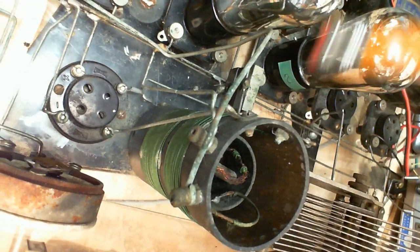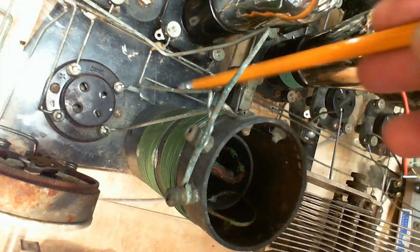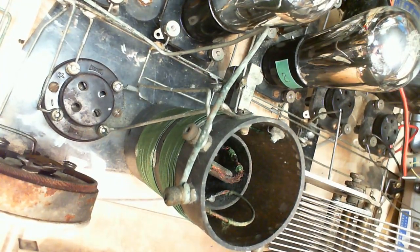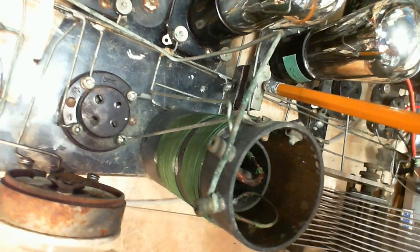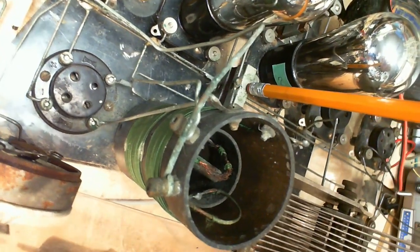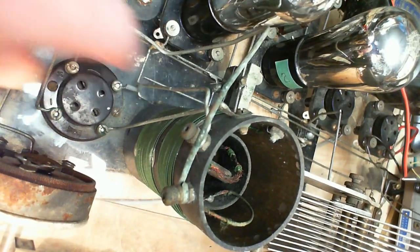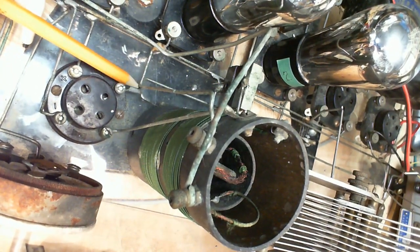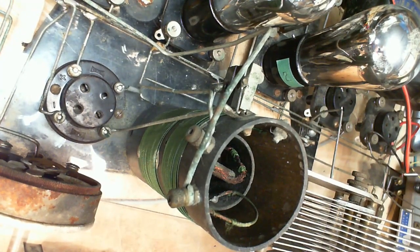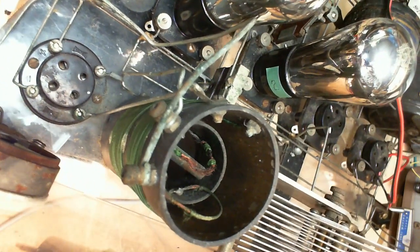Maybe it's one. Now there's terminals on the bottom here, terminals in the top. So you can take a guess: top terminals, top coil; bottom terminals, bottom coil. The bottom coil is the one that's hooked up with this capacitor over here. There's actually a gap there. When you're looking in the camera, you don't see three dimensions, so you can't see that there's gaps necessarily. Things look connected when they're really not, just because of bad angles. Same thing happens when you're looking with your eyes, though.